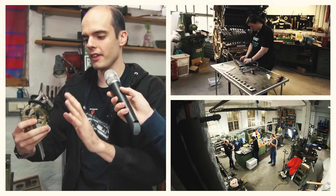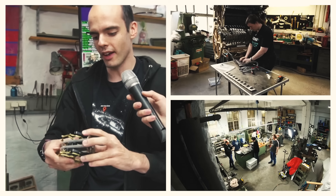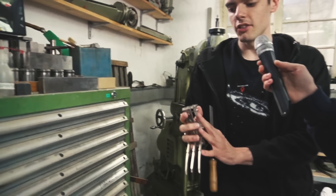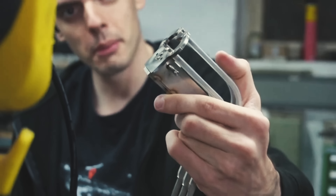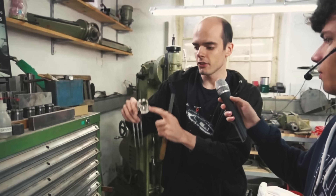So we still need to find all these parts, get them assembled, and ultimately back on the machine. Before we can do anything, these need to be filed down. You have all these welding artifacts over here — they are on this side which needs to go on the machine. This will be flat against it, which it can't be if there is any welding left.